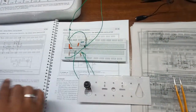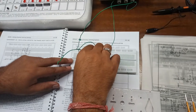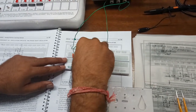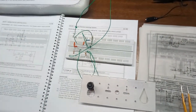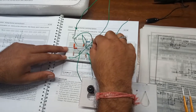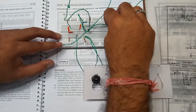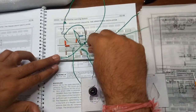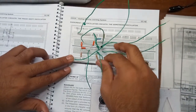Now take a hook-up wire from the emitter terminal. Connect the collector terminal and the other wire to the emitter terminal. At these two points we will observe our oscillator waveform with the help of the CRO. So again verify our circuit — always verify the circuits. We also need to connect the emitter terminal to ground, which we had forgotten to connect. That's why I always say to verify your circuit before switching on the power supply.